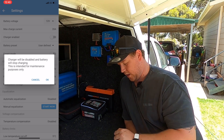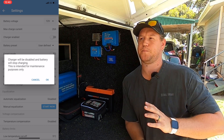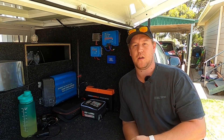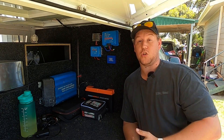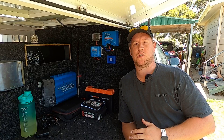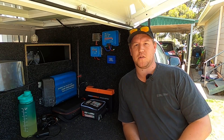The reason you want to do this is so that once your battery wakes up, it doesn't get a full hit of solar charge or DC-DC charge straight away. It's going to be a little bit softer on the battery and actually let the wake-up process happen properly.